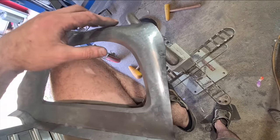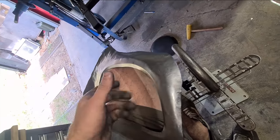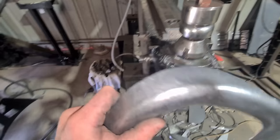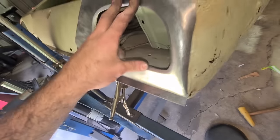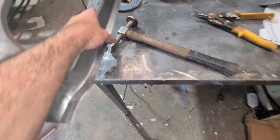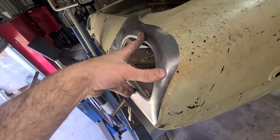As you gradually bump it around, the sheet will tell you what it needs — it's bunching up in that area which means it wants to be shrunk, so you've got to take some material out of that corner and it will let it pull around. Once I've got this area semi roughed out I can move along the panel — it sort of locks it into the corner and stops it from walking away on you. This is just normal hammer work with a dolly and the sandbag — so far no machine work besides the thumbnail shrinks. You could easily do those with just the tucking tool and manually shrink, but I've got the machine so why not make things 200 percent faster.